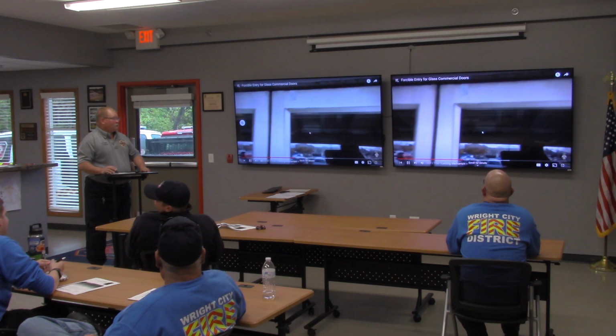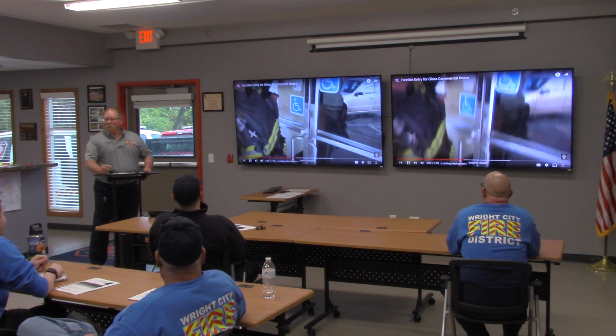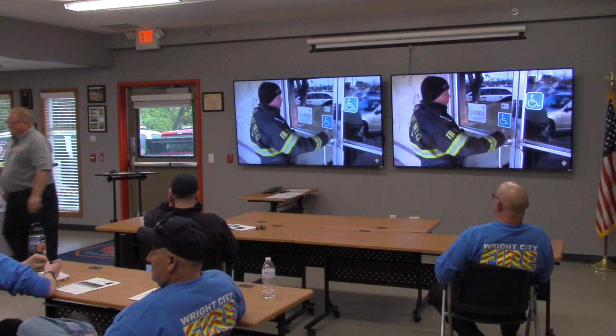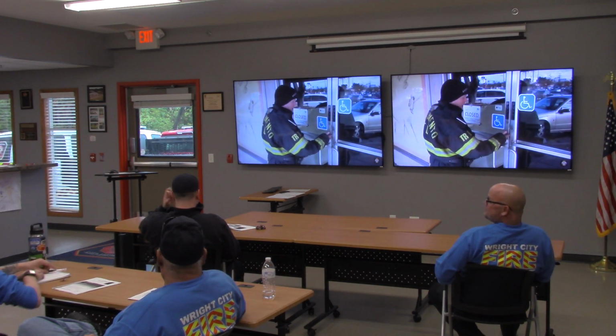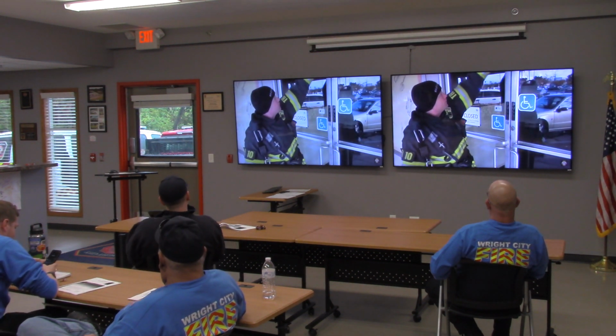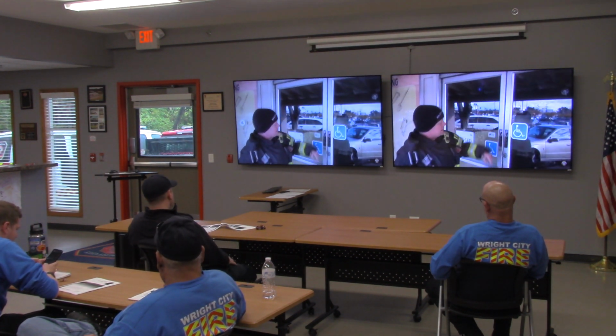Channel of the door. So every time that door locks, it locks the channel here, and there's a pin that goes down into the threshold. So if you were to walk up and use irons, like you normally would on an outward swinging door, you would actually be forcing it from the furthest point where the resistance is.